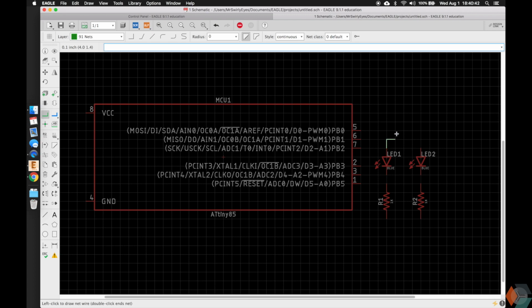So we can click here, left click, and you'll notice that it starts to bend when you move it. You can change the wire bend style. However, for the schematic, I would always use wire bend style 0, which is a right angle tool. And for the board, we'll use a 45-degree angle tool, but for schematic, always right angles. It's just convention. And then you'll notice it turns green here, and we'll make our connection with a left click. And then it'll stop us once we reach 2 terminating edges. So let's go ahead and route the rest of it.